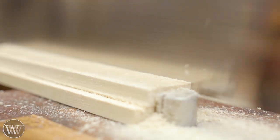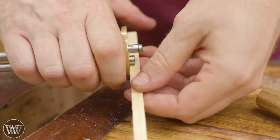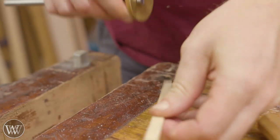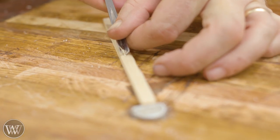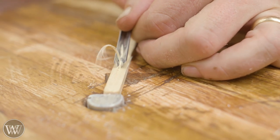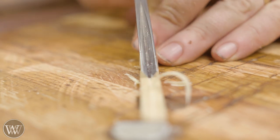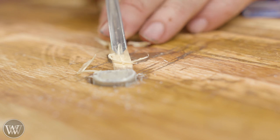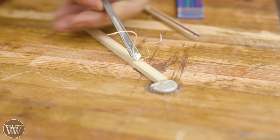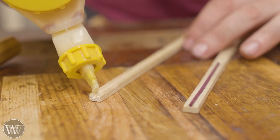Yes, this is a lot of work to make a set of 12. I was expecting to make all 12 in one day and I probably could have, but I wanted to get the video out on time. I'm putting a line down the middle of each half and I need to cut a recess for the lead to fit into. I tried a few different approaches, then thought — I'm a hand tool woodworker, let's just grab a gouge and run it down. I got a V-tool with a bit of a rounded tip, drew my first line carefully, and then freehanded each half in 15 to 20 seconds. Then I put the lead in and checked how deep it went, which let me know when I was at depth.